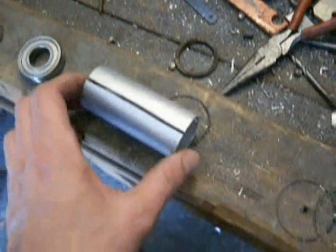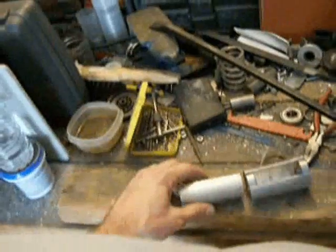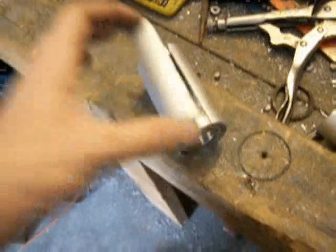So as I was saying, I'm going to make one of these now. Here's my piece of pipe and I already cut it. Now I have to expand it out so I can fit these ball bearings inside there. Now I have to measure a piece to put in here — here it is clamped with a little line on it. I'll cut it without the camera so it won't hurt me. Yeah, that's hot. So now I'm going to go wash it and weld it.